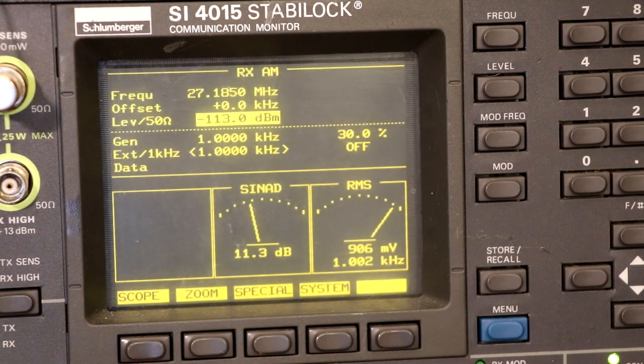There's a massive advantage to using dBm, in that if you see something written down in dBm, you always know it's a reference to, it doesn't necessarily mean 50 ohms, it could be 75, but as long as you know the system you're dealing with, whether it's 50 or 75 ohms, you won't have any problems. Whereas when things are just listed in microvolts or PD, you can get in a whole world of pain.